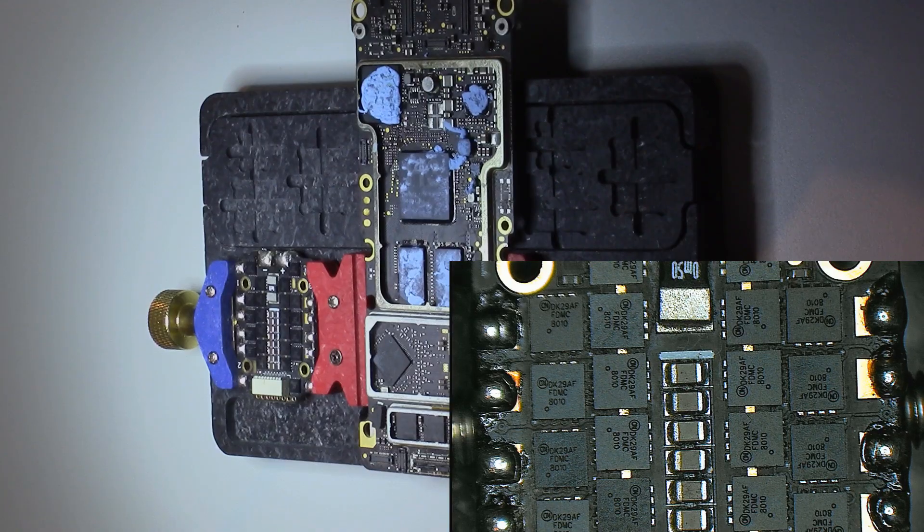This microscope was sent to me by Banggood and I'm very happy about it because this tool will help me produce better content for you guys. All the details and link to this microscope you will find in the description of this video. I've set it up and installed the camera and will also test it out. One thing to note: this particular package didn't have the 0.5 lens to increase the working distance to 165mm. So be careful when you buy it — also buy a 0.5 lens, because without it the working distance is quite low with the included lenses.